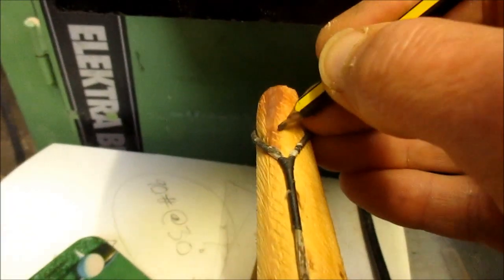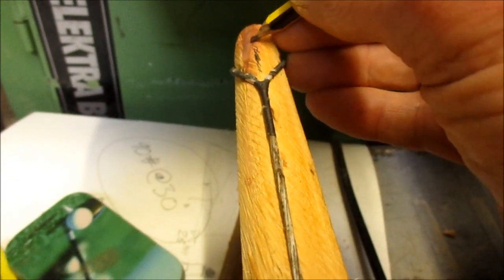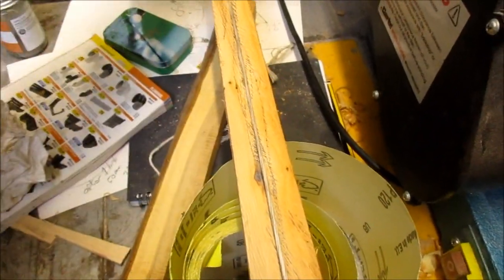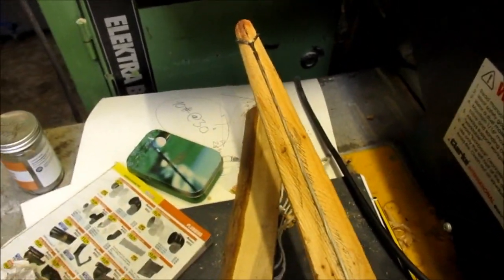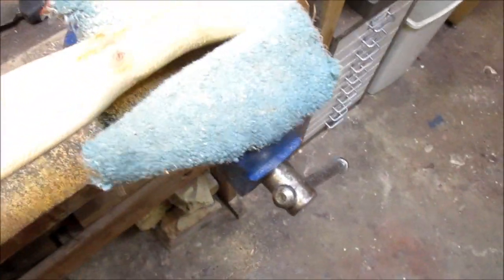That's not a problem. Similarly at this tip I want to be just a whisker over to this side, and again that will help me to narrow the tip. There's a pencil mark where I want to take weight off, but if I narrow the tip towards there from either side, that will help remove some of the weight. Then take some more off the belly as well — it's getting very close now.